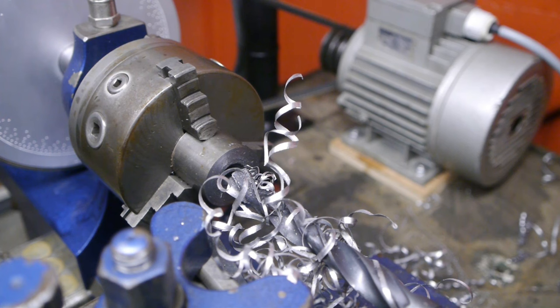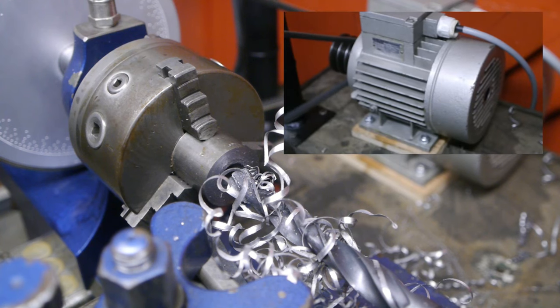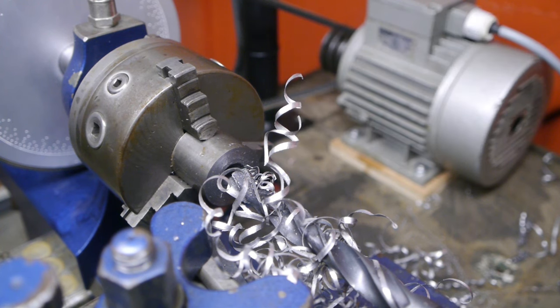Anyway, I stop testing now, because I know enough and the motor vibration problem seems to be getting worse. The lathe, on the other hand, seems to work fine. At least just as good as my other old lathe. And I was kinda surprised with the amount of power that was available at a low frequency. Although it might not do so well when the workpiece has a bigger diameter. But I think I should be able to improve the low-end power by selecting another volts per hertz curve in the frequency drive. But for that I need to study the manual.